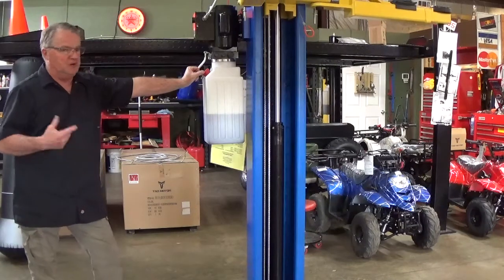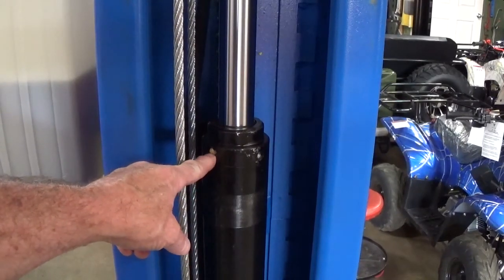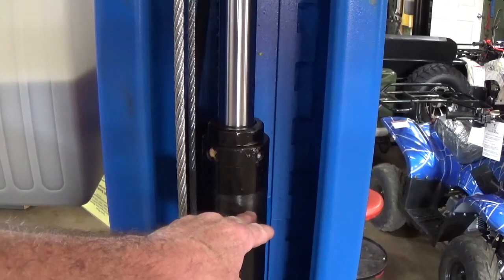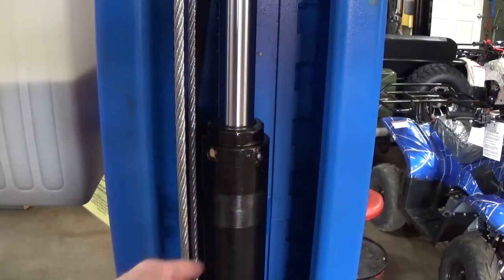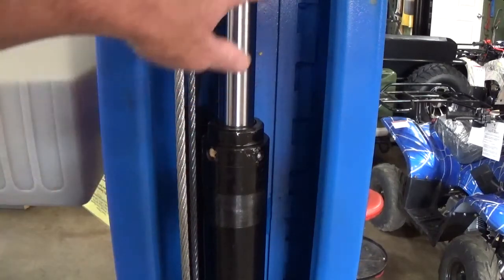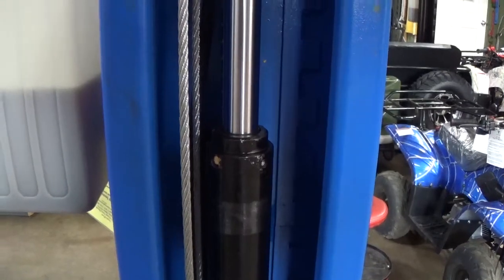One problem you may run into is a cylinder that leaks. Right here is your cylinder and right here is a vent hole - it looks like an old-fashioned fuel filter on a carburetor. If fluid is coming out of this hole, the seals on the piston are bad or there's a piece of dirt not allowing the seal to seal against the cylinder wall. If it's coming out of here you have a leak in that seal - take it apart and clean it; you may need a new seal. When you first get it fired up you may see some oil coming out of there from packing during assembly. If you have oil on your floor when you first get it, there's probably a lot of oil inside the column that leaked down - just wipe it up.